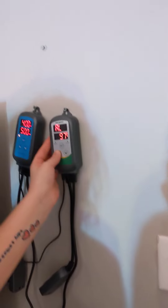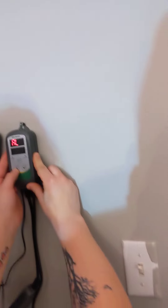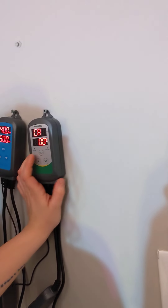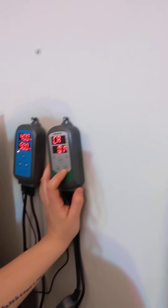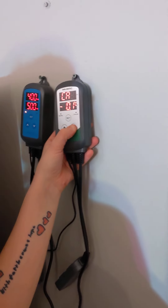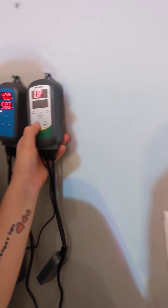15 is the actual temperature so if it goes below that, we'll set the low alarm to 11.1. Now this is the PT setting — we're going to keep that at zero. PT is designed for air conditioners with a compressor: it allows the compressor to build up pressure and dissipate before kicking on, which prevents the compressor from burning out.